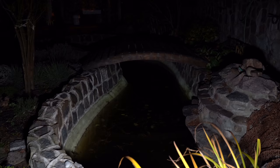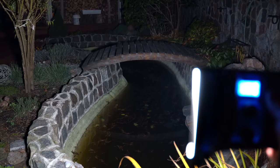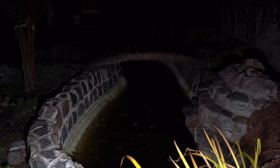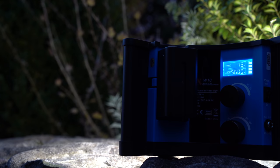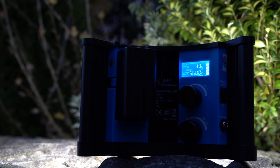Now let's talk about the actual performance and why I think this light is so great. I found the light to be very bright thanks to 36 watts of power output, which translates to about 450 lux of brightness. The light spread is extremely wide thanks to the 180 degree beam angle. Other key specs include a high CRI rating of 96, and the panel uses 600 LED lights.